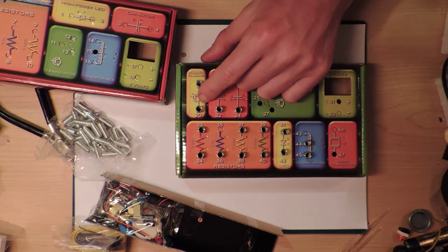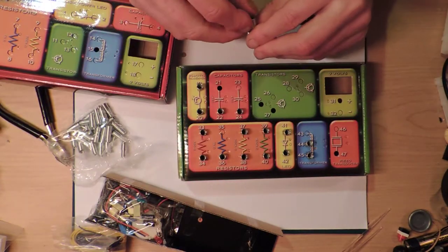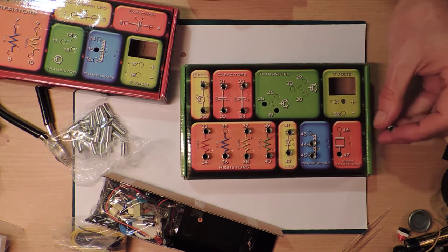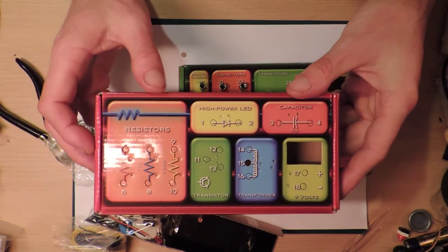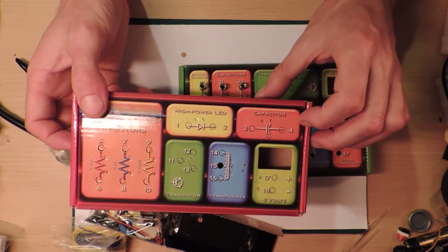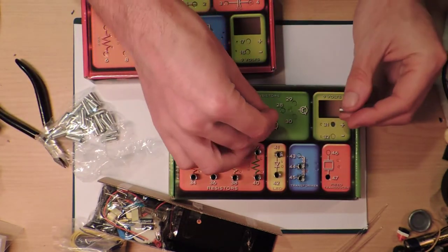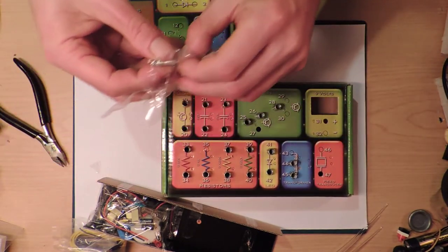So there's your photo transistor. So that's obviously a receiver, yes. It's just going to be connected to that somehow. And I'm assuming the rest of the circuit's just basically to make buzzing sounds or something. Well, there's a piezo transducer, so I think this is probably the thing that makes a sound. And the other one over here doesn't have any sound making things, but it has a transformer in it. So it's going to be interesting to see. There's some oscillation going on there, so it's transmitting that way. But it seems awfully complicated just for something that transmits via light.